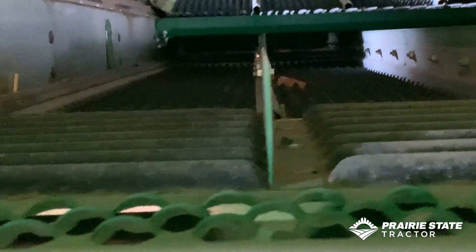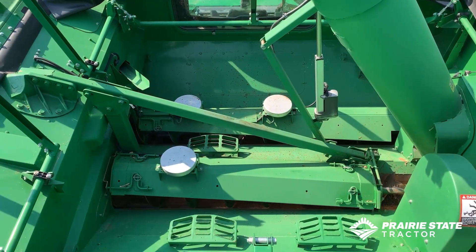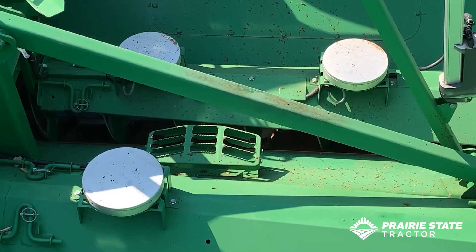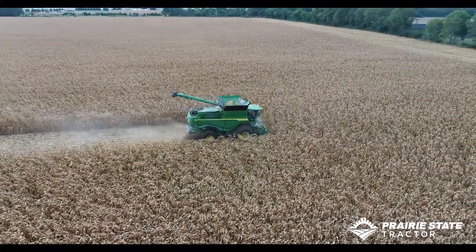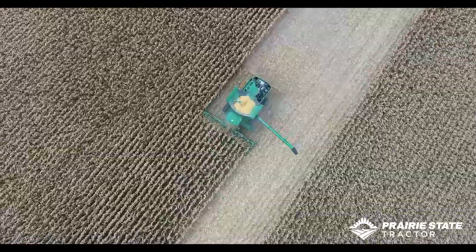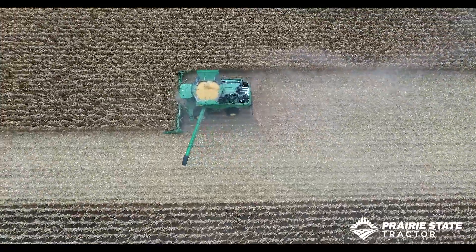As we go through the feeder house, we have the two rotors to get crop feeding equally to each rotor. The feed accelerator has a Chevron design to feed it into each of the rotors. Those rotors are 24-inch rotors and they're 15 inches longer than the previous rotor. With that 15 inches and having two of them, we're doing about 40% more threshing and 80% more separating on those rotors. We have two grain loss sensors per rotor, and that 15-inch length is essentially an additional separator grate in the combine.